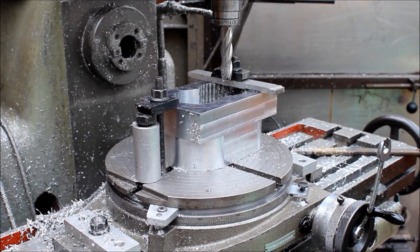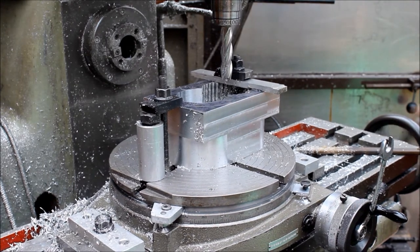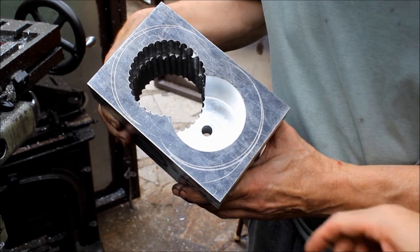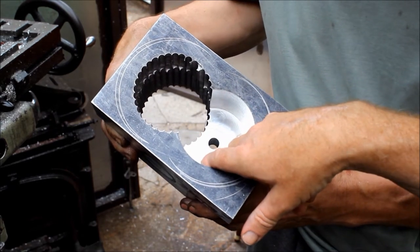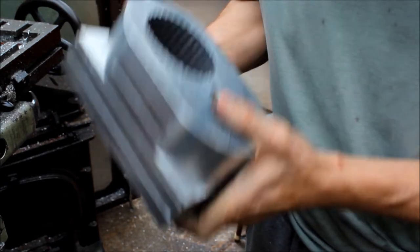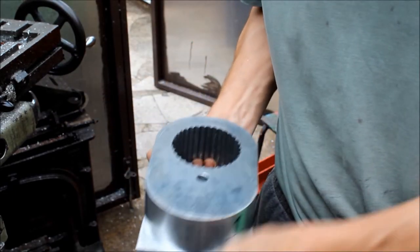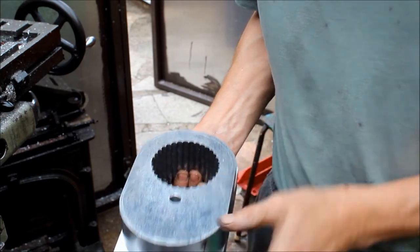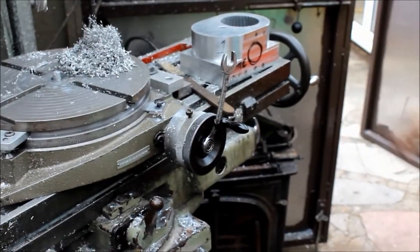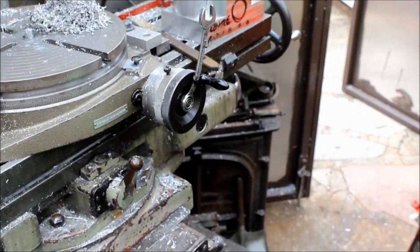It's quite heavy kit. It's been designed so it can go the depth. So carry on then and we'll see what happens next. I can take it off the mill now you've done that. So there it is — you took it off the table. You've gone about three quarters of the way down. So what we're going to do now is set it up with the mandrel there, take that out, then clamp it on there and bore it.